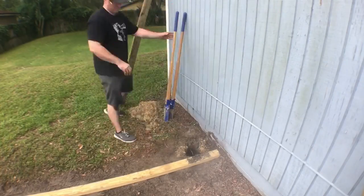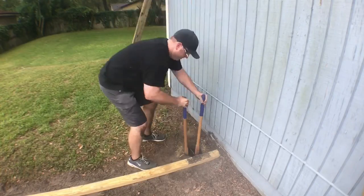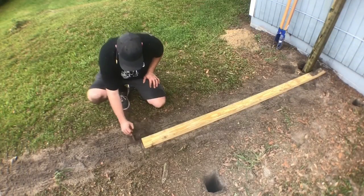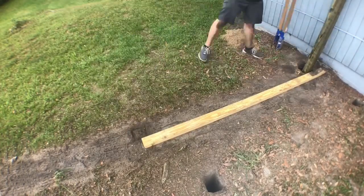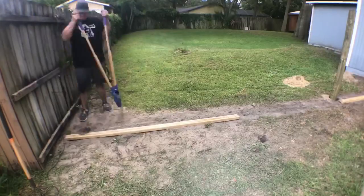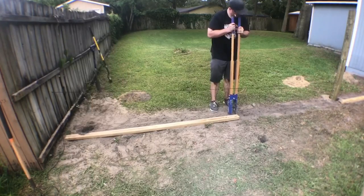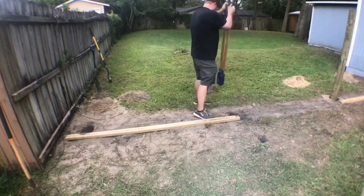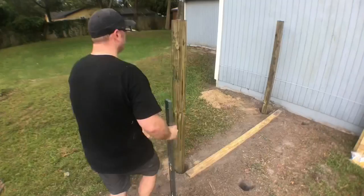I'm using an eight-foot two-by-four to give me a reference on where I set my posts. The 23 feet is great because it allows me to buy three pre-made stockade panels and rip one a little bit less than half to make those two doors. As I'm digging these post holes, I'm taking careful measurements — each one is 30 inches in depth.